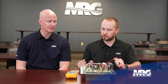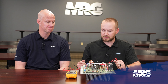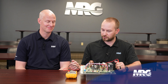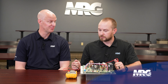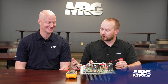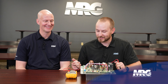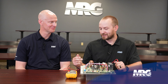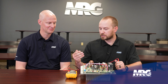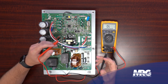For the bench test, make sure everything is completely discharged - that's the P3 and N3, positive and negative. The first thing you'll want to do is inspect the board - look for any burn marks or anything obvious. If you see a burn mark in the middle of the board, it's failed. If it smells bad, use the sniff test - if you smell burning, there's probably burning. After your visual and nostril check, go through and make sure all fuses are intact. Turn your meter to the audible beep test, confirm the meter is functioning, and check all fuses.